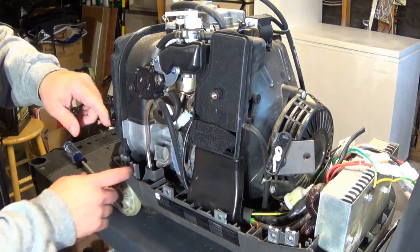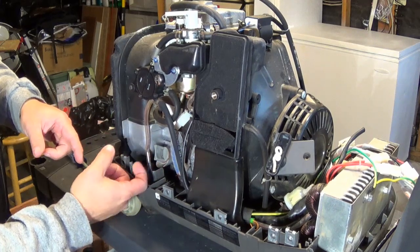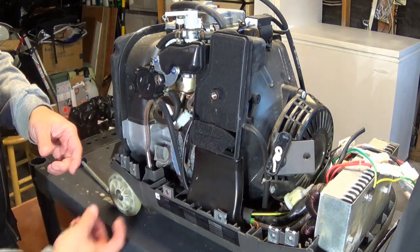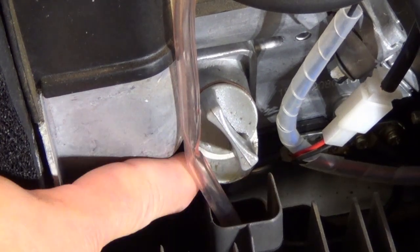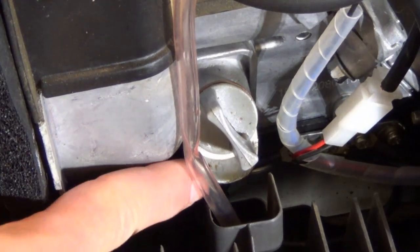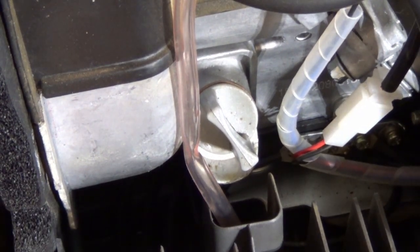One thing that's kind of interesting is, it's hard to see with the case over the top, but this is where your dipstick is. Just like my Briggs and Stratton generator, there's a little bit of a lip right here, and then right underneath here, it's right here where you can put the oil in and drain it out. There's a little plastic tube, or a chute that goes all the way to the bottom, so when you're draining the oil out, it's going to catch into this little area, not spill all over the place — you could easily just put a pan right underneath the generator and catch it all without it making a big mess, which is a nice feature you'd never know was there unless you take the whole cover off.